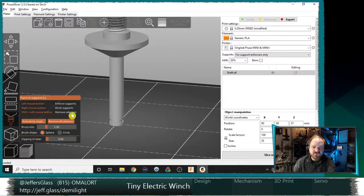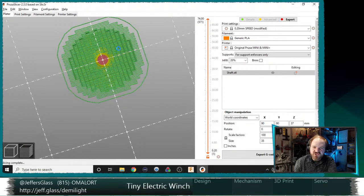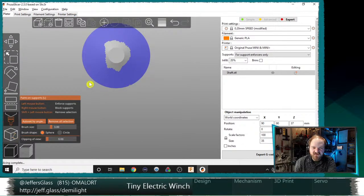So what I'll do, and there's a few different ways we could do this, is come in here and increase my brush size a little bit, let's say 3 millimeters, and paint a rough layer of supports all the way around the outside here, but not touching the center. I'm going to be pretty casual about it. But I'm going to slice this, and we'll see that it's generated a set of supports. I've gotten a little too close. So we'll come back here,